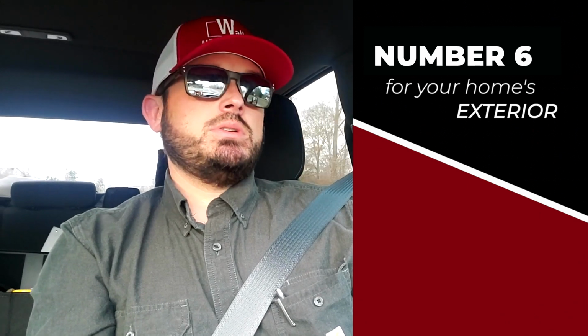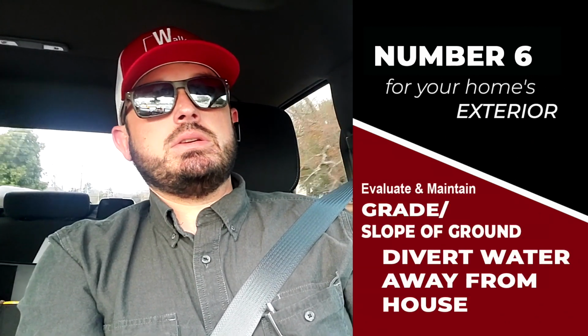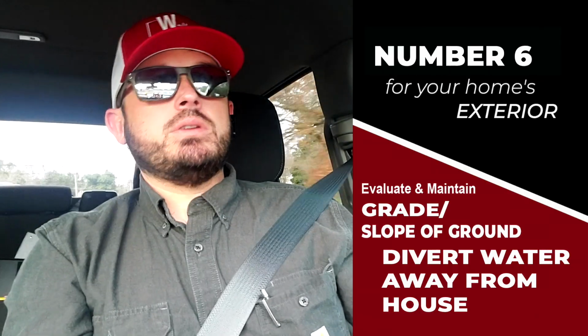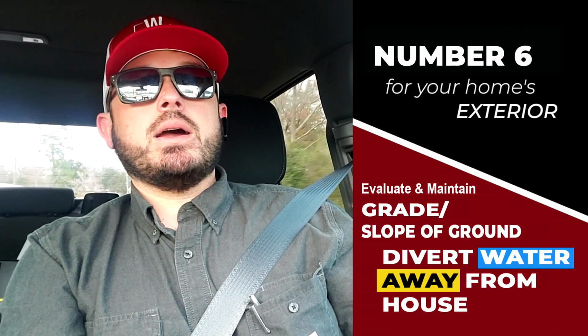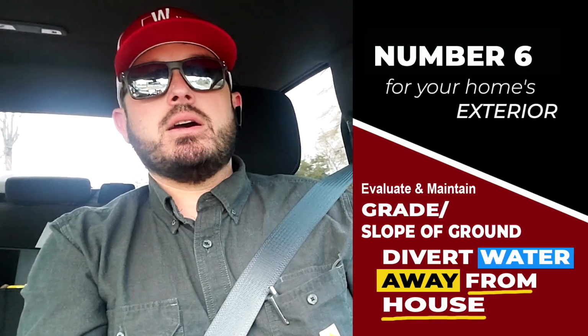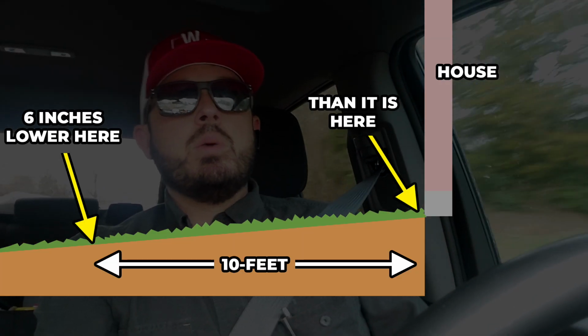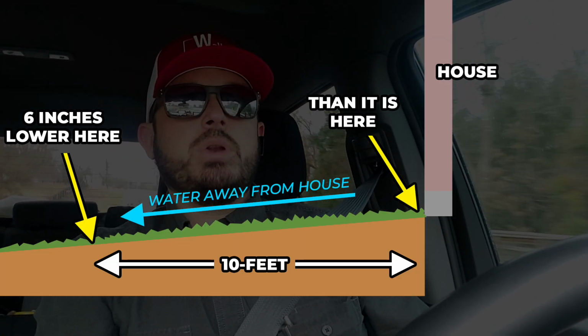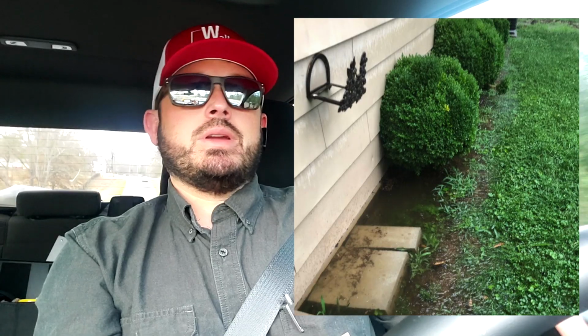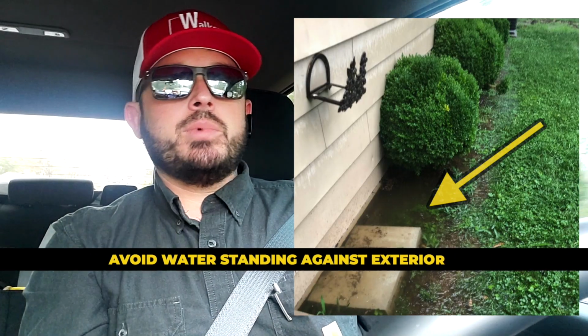Number 6, it's a very, very easy one, is to keep the slope, the grade around the perimeter of your house sloping away from the house. Over time, years of adding mulch and pine straw can build up, and it can create kind of a trench around the perimeter of your house where water will just sit and collect.